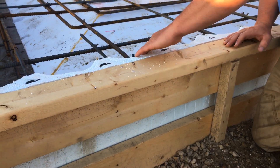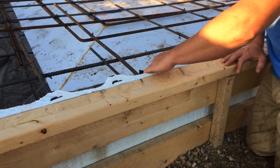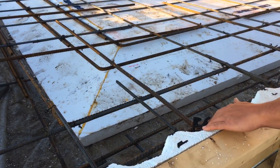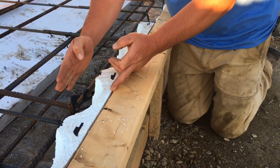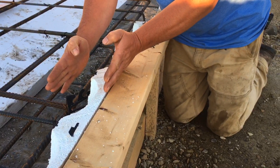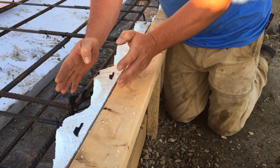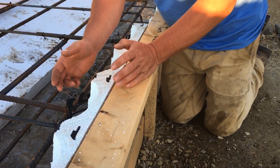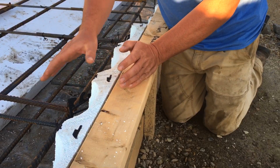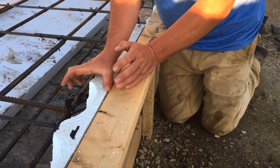The other thing we've done is these quick taper tops — we just cut those out with a sawzall because what happens is you'll have a 2x6 wall sitting like this. You can't have a 2x6 overhanging its support by more than one-third, so we had to dish these out so we had proper bearing for the 2x6 wall.